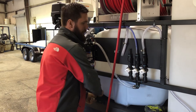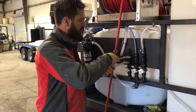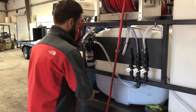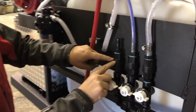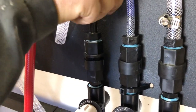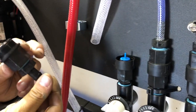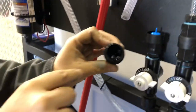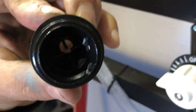What we'll do is take this check valve apart — put a wrench right there, wrench right there, and spin it. They come apart real easy, they separate right at the joining. And there's our culprit: right inside there we've got a little tiny piece of plastic.